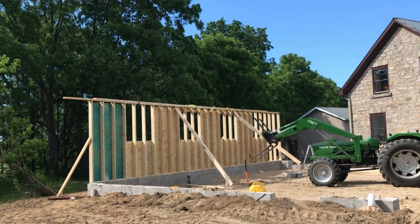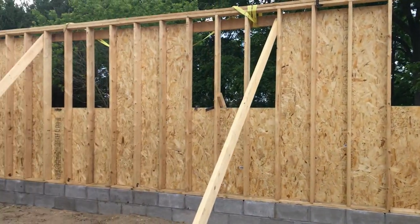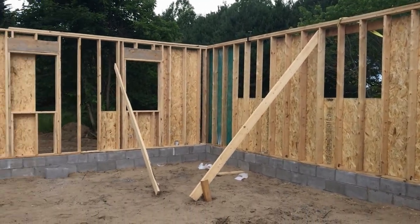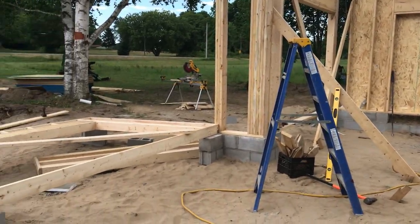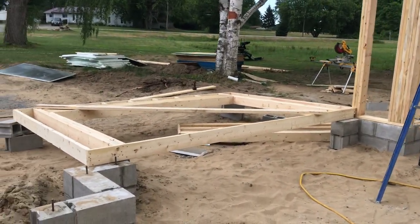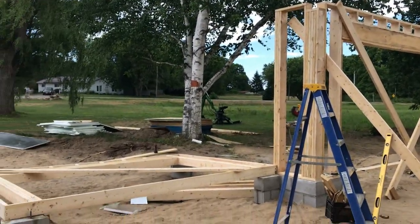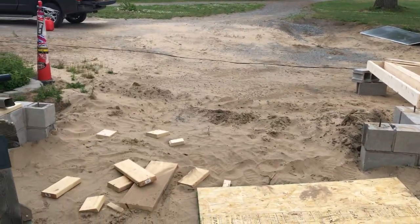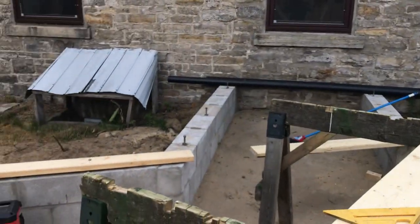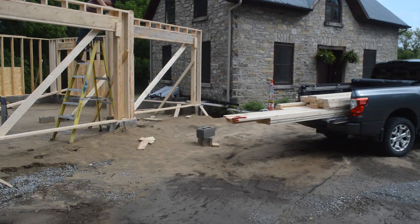Each wall after that I built a little smaller. Once I got all my struggles figured out, everything was simple after that. So the back wall is good. The west wall has two windows and a door, so it was a little more time consuming, but I did that in two sections — a 14 foot and a 12 foot to give me a 26 foot wall. And you can see I got my garage doors starting to be framed, so there'll be three garage doors across the front. I'm starting to lay out the sill plate for the east wall, and I got the third garage door opening framed and upright.